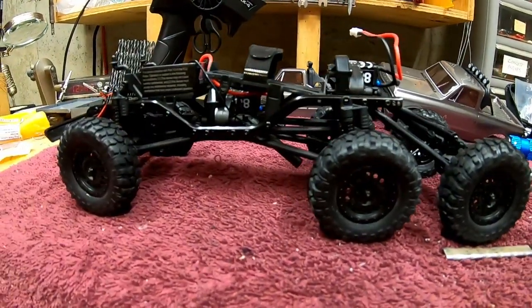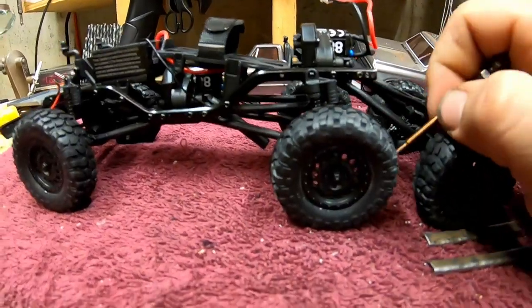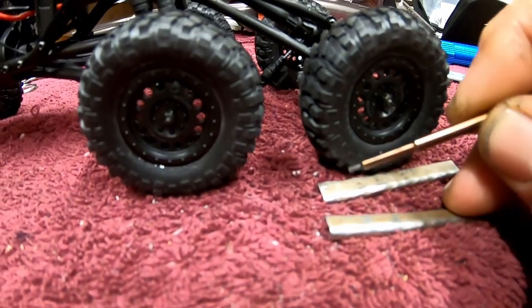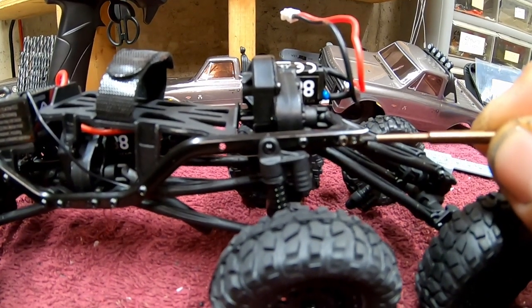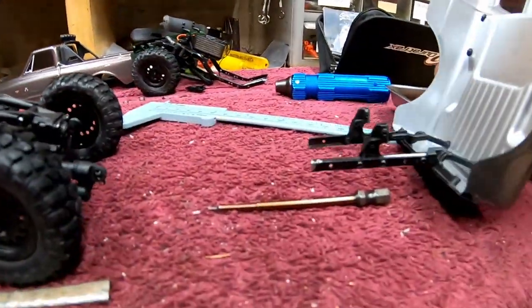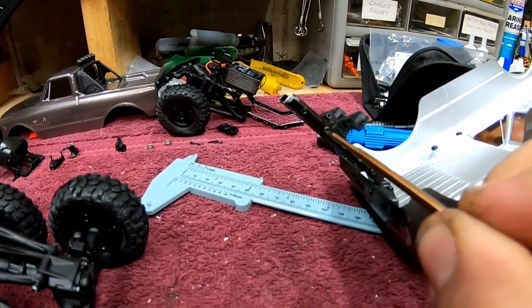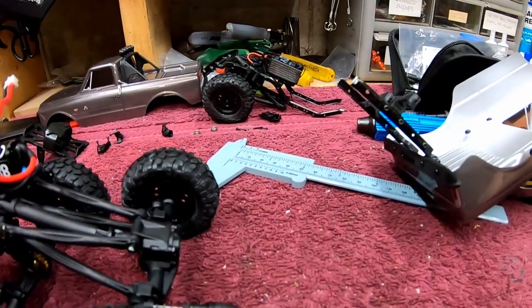So what I'm going to do now is put this down. This screw right here, we're going to drill a hole right up in the front, right up in this neighborhood on both of them, magnetic tool, so that this screw can go through, and then we're also going to drill a hole to correspond with this one so I can have 2 bolts holding it so that it can't walk up and down. And then on the rear piece, we're going to use this hole and this hole, so we'll just drill corresponding holes to go into there.